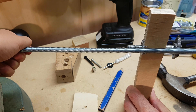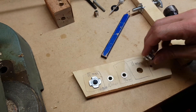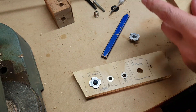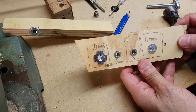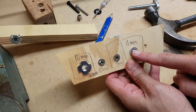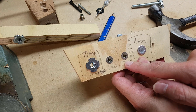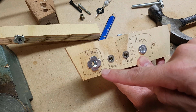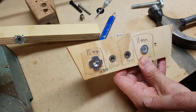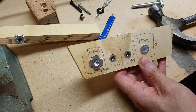So those are different types of inserts — I've played around with three of them. To summarize: an M8 rivnut needs an 11mm hole, an M6 insert nut needs a 9mm hole, and an M8 T-nut needs a 10mm hole. Alright, see you later.